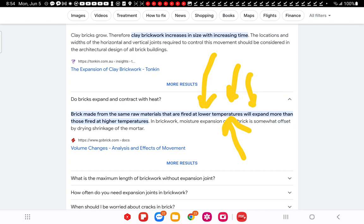And we don't know. Remember I talked about it depends where you get these tiles from. Some are just laid out in the sun to dry, and there's no extra kiln drying. It's the sun's heat that makes this tile stable, if you will. So whatever temperature that was, imagine you taking it to a location where the heat increases, it will either stay stable or it won't, because it's beyond its range that it already was stressed at. In temperature, thermal stress.